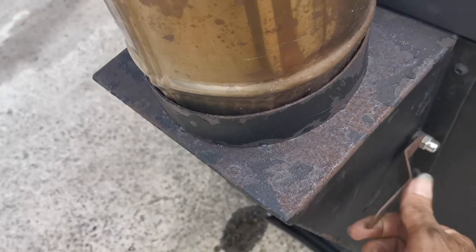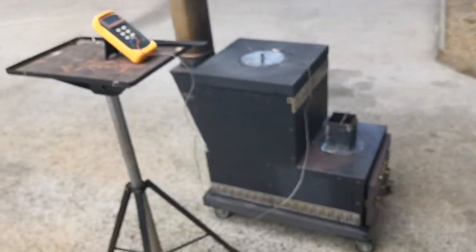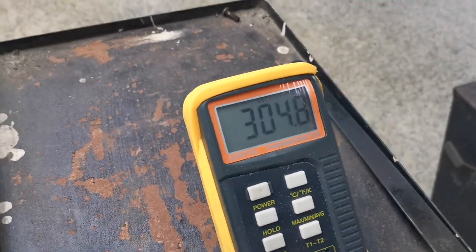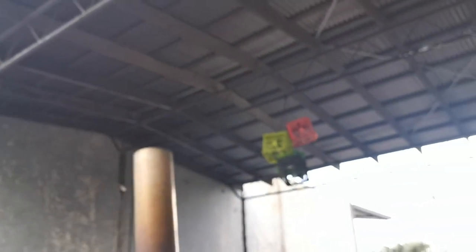Close the lever down to create a little bit of back pressure, and it will heat up the stove a bit better. We'll get more temperature trapping in the top and that temperature will go up. And we can also see it's burning quite clean — there's a little wispiness there but that's pretty clean.